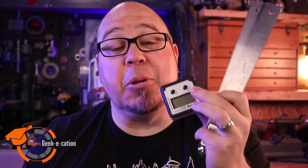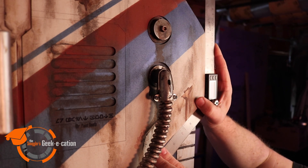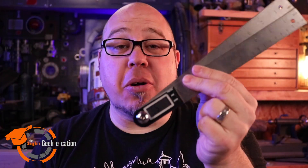A great example of both of these tools being used together that we did recently was our massive paint booth build. The paint booth had multiple pieces of material all with specific angles that had to be matched up almost exactly in order to pull off the look and make everything fit together. I was able to use the digital protractor along with the angle gauge on the table saw to get all of the beveled and angle cuts exactly where I needed them so that the project looked uniform from left to right and top to bottom.